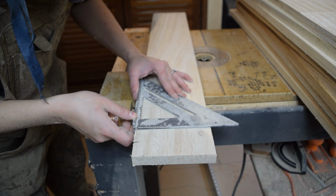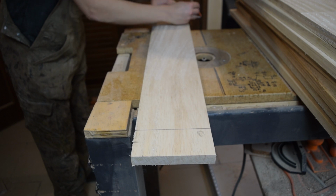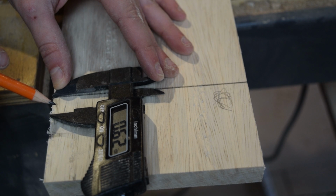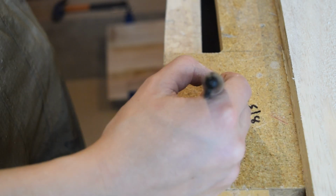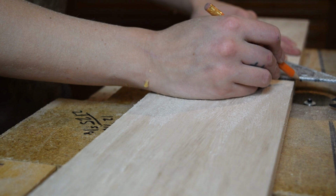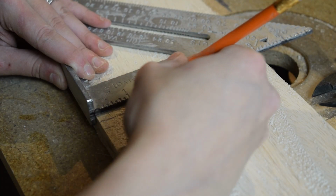To make sure the wine rack sat centered on the short side face, I made the interior marks of the top and bottommost lap joints the same distance apart as the short side opening. Then, using the depth of the gluing shelves, I marked the outer edge of the lap joint. With that done, I took the total interior distance and divided by 2 to get the center lap joint marked. I divided the shelf depth by 2 and marked either side of the center point.